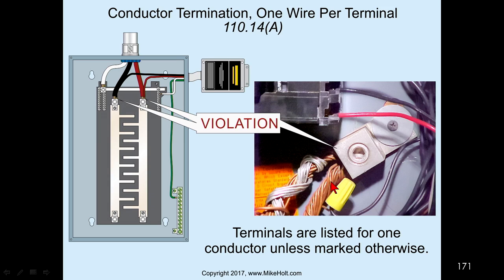We twisted the copper, the aluminum, brought it out of the way, put it on their lug, got a sheet metal screw, got the fender washer, put that baby in there. You got to realize in the 70s, we did not understand what equipment grounding conductors were. We were just getting these things out of the way. There was a mechanical nuisance. Then, of course, we've gotten a lot more educated, realized equipment grounding conductors terminate in terminals in equipment designed for that application.